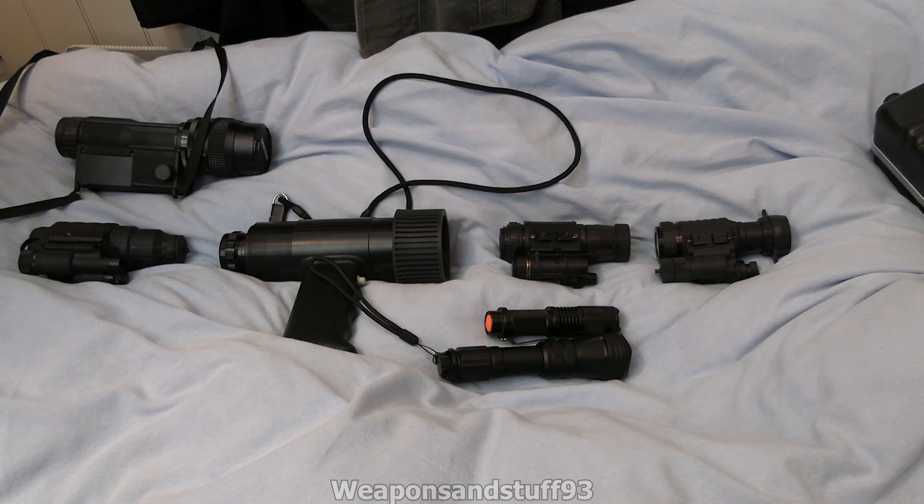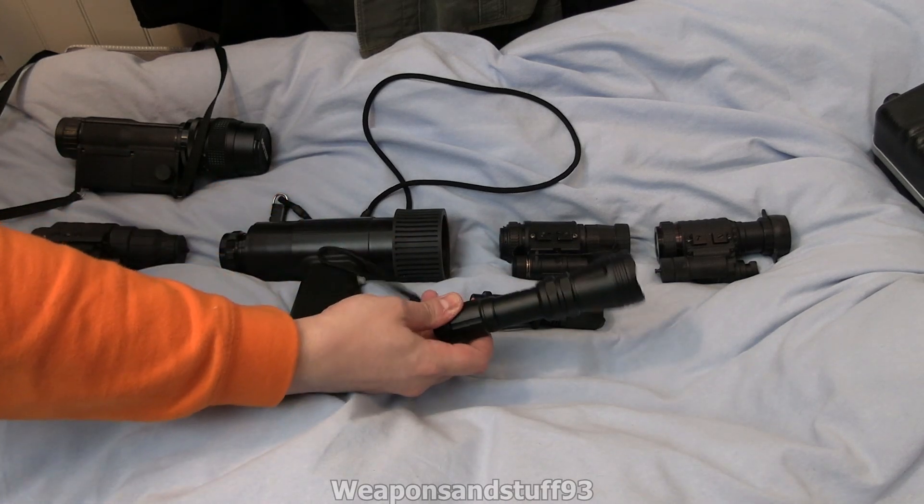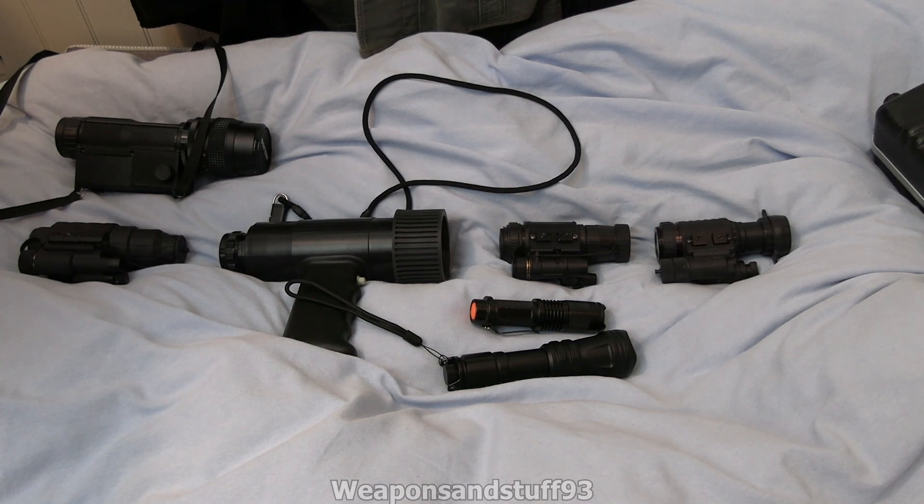The PNV57A, despite being a Gen 0 unit, does amplify light a bit — you can actually see better with it than with your eye. But what it can see is a massive infrared range spectrum: 400 nanometer to about 1200 nanometer. That's a massively high range, because a lot of these night visions might only see about 800 to 900 nanometer. So the idea is all the night visions should see the 850nm torch, but some might struggle with the 940nm — it will be a bit dimmer or just not visible at all.